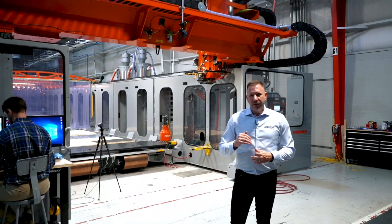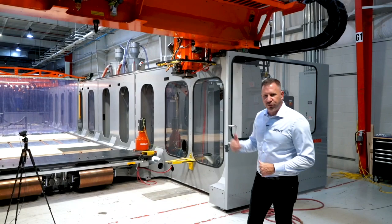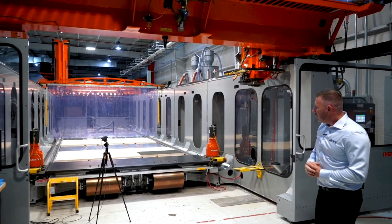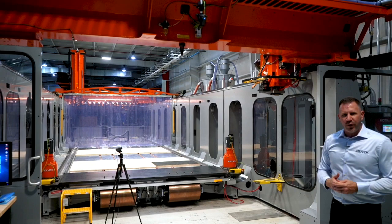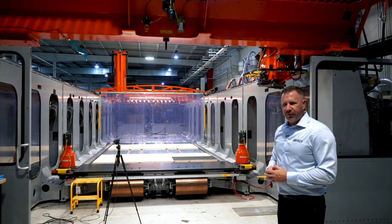This particular machine is set up to have a 200-pound-per-hour throughput on the extruder on the printing side on this gantry right above my head, and we can set this machine to print in two ways. The traditional way that most FDM printers work is referred to as HLP, where layers are stacked vertically one at a time to create the shape. Unique to this machine, we also have the VLP option, which means we can actually print sideways — imagine the part growing towards you as it's being built.